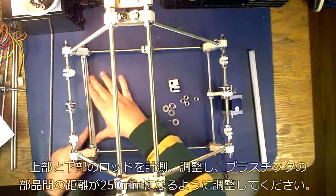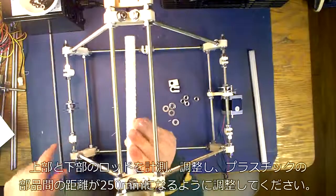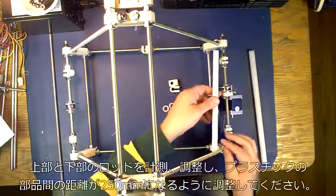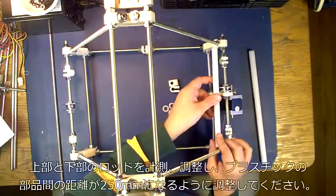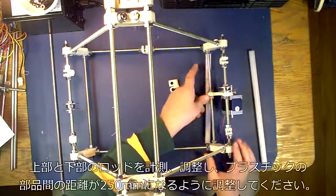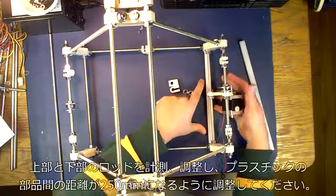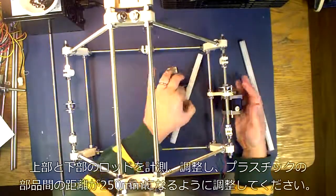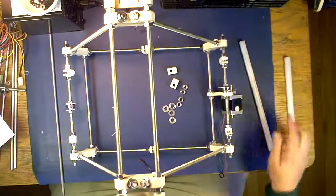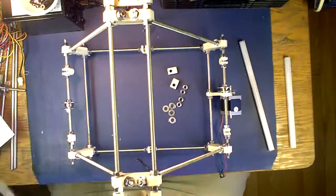When you're jigging the inside frame, which is all this, what I generally do is start with the feet. So feet, there, then as close in this side as you can here. Now this one's sort of tricky because of the fender washer. Just get as close as you can. As long as all these are straight, the outside there will be straight. So you jig all the way around. I'm not going to show you the jigging process because it really does take 30-40 minutes to do it right. After you get that done and everything's tightened and jigged, the frame should be quite tight.